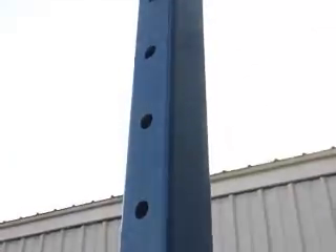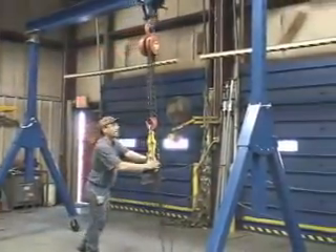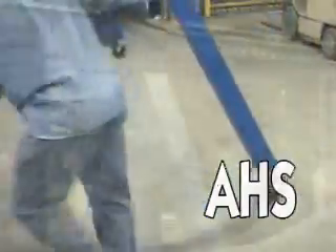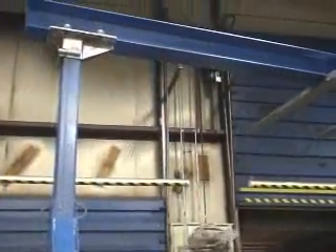To begin, Vestal offers over 50 different sizes of fixed and adjustable height steel gantry cranes with capacities from 500 to 10,000 pounds. Series AHS adjustable height cranes are ideal because of their portability and feature the added benefit of an adjustable under I-beam service range. Height is adjusted in 6 inch increments.